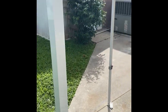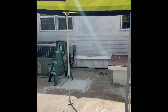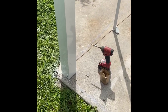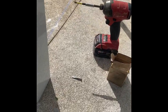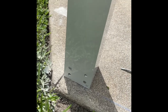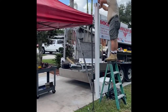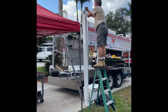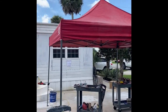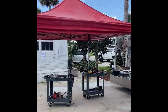Taking into consideration the tilt of the concrete and the pitch of the roof, we cut our first beam and fasten it in at the bottom. We screw right into our u-clips, which mounts our upright into it. We got our two outer posts cut to the proper length, now we run a nice straight line across so our inside posts level up to that top string.